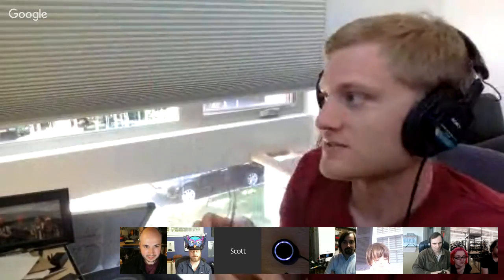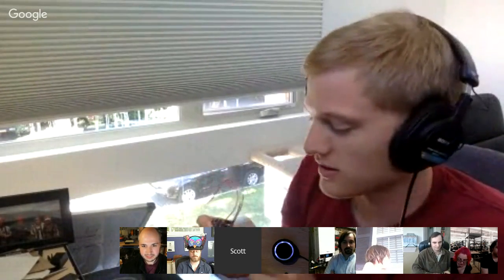Basically, I stopped doing it because I ran into issues: although the ESP8266 can be a host AP, it doesn't actually route between things that are on the network, and that was the crux of it for me, because I wanted different networks. I wanted you to have 2 of these out in the field plus your phone on the Wi-Fi, but couldn't get it working. And then I came up with some cooler stuff that you'll see in a couple weeks.